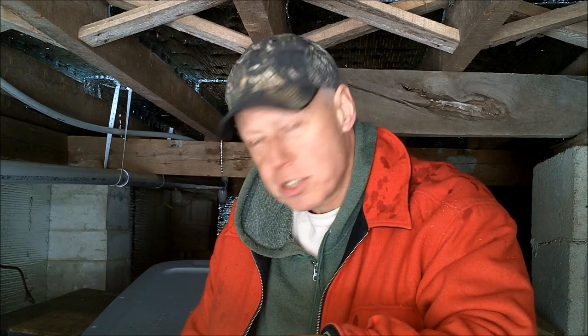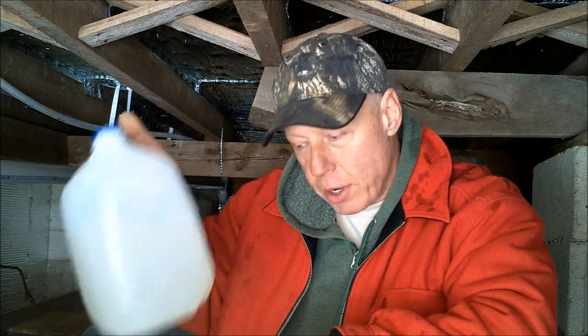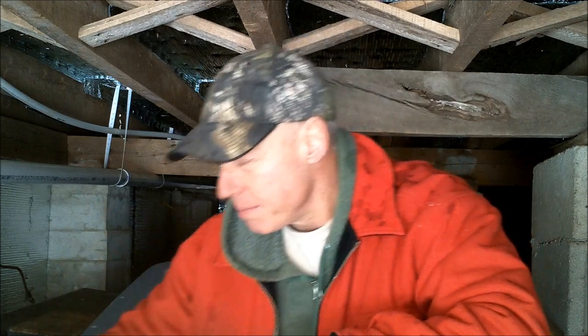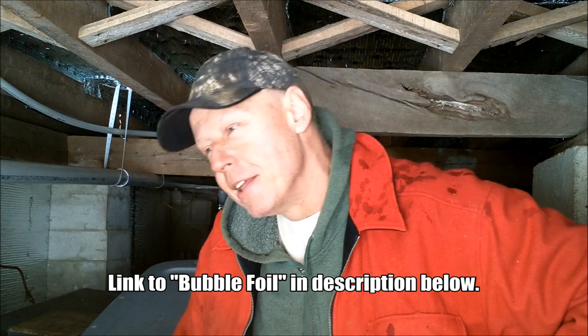Yeah. So what do you make of that, huh? The underside of the floor is dry as a bone. The ground outside the skirting is as hard as concrete. But yet inside the skirting, it's as soft as it was summertime. And this jug of water sitting on the floor here, on the ground, is liquid and not ice. I think we're debunking a few myths here today that the bubble foil, radiant reflective insulation, doesn't work.